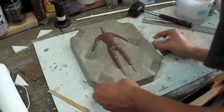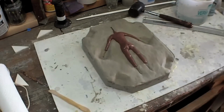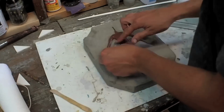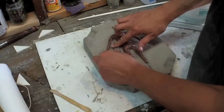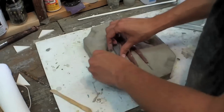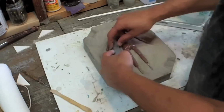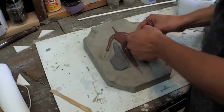Now this next stage is actually really important. Obviously we haven't gotten to it yet because I'm still cleaning that mold. But the next stage we're going to add recesses on top of what's already there. So we use some wet clay and we're going to make some shapes around the body of this, about a quarter of an inch, a little bit more than a quarter of an inch deep. And what these serve as is when you pour your next layer of UltraCal over this, or your second half, this is going to be a recess inside that mold, and that allows for